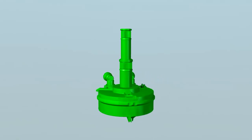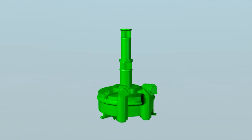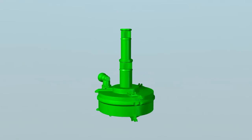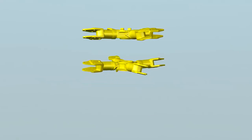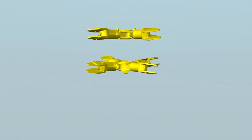The internals of this gearbox, including material selection, gear count, gear size, and placement, have been specified. Weight and power capabilities have been derived from this work. This is a rendering of the computer-aided design solid model of the rotor hubs. Material selection and distribution are sufficient for all predicted blade loads and flight conditions. Weight and durability have been derived from this work.